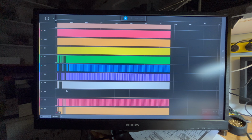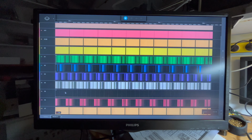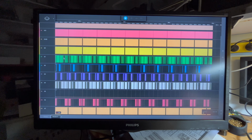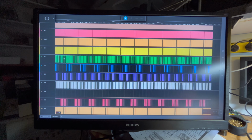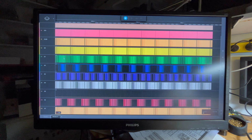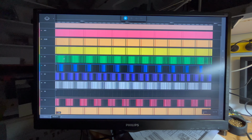Okay, so O5 is D15, the ROM chip D15. So maybe that's always active. But it never is inactive? I would have thought we should see it go high sometimes if these are active. So if we wanted to see it go low, for O5 we need high, low, high. A11 high, A12 low, A13 high.